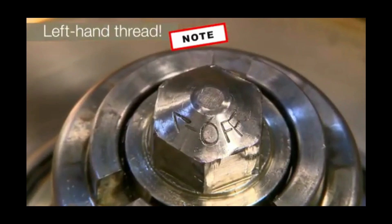If there are enough comments I'll make basic videos on how the purifier works — so you can watch the parts and visualize where the oil and water are. These things help with troubleshooting. I can also make a separate video showing the path operating water takes for closing and opening the bowl.